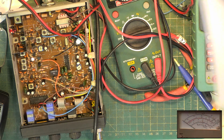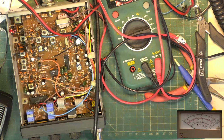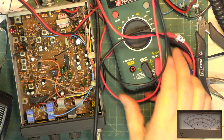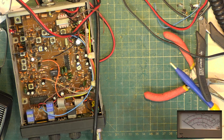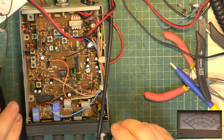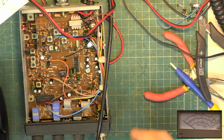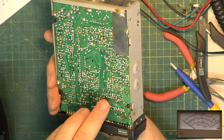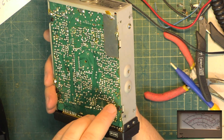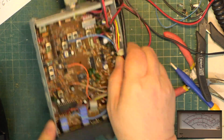Right, so that's a good start, folks. So I'm happy to do the frequency now. Let's go over to, I'll put this silly scope away. I'll put this away. And that is hopefully a lesson to folks. I'm going to clean this board with isopropyl. That pad had become hygroscopic and was causing the processor to short out, but not directly, you know what I mean, just in microamps.